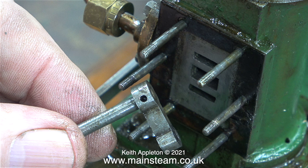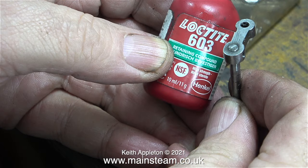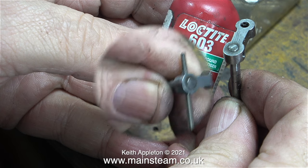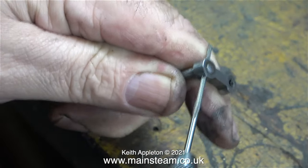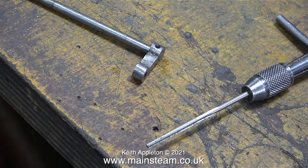The operating arm on the shaft wobbles because the bolt that originally held it in position had sheared off. To drill out this very small broken bolt I'm using my Proxxon motor-tool drill press — a very useful thing to have in the workshop for fine drilling operations. I like a belt-and-braces approach, so once I drilled out the broken bolt I refitted the arm to the shaft using Loctite 603, then used a taper reamer to ream just about all the way through.